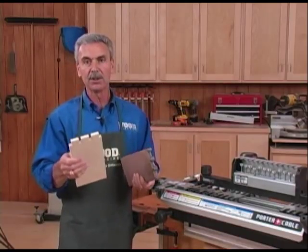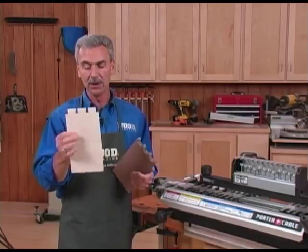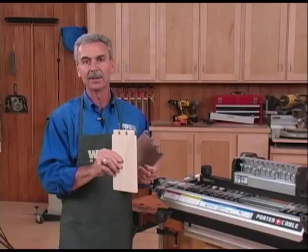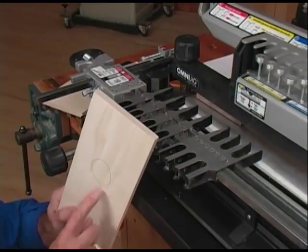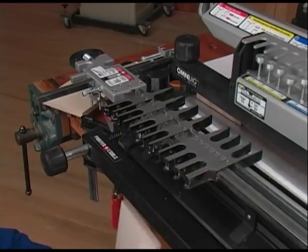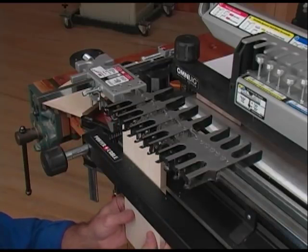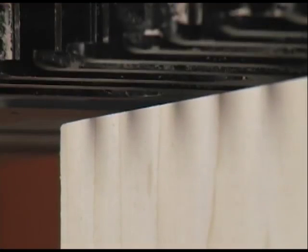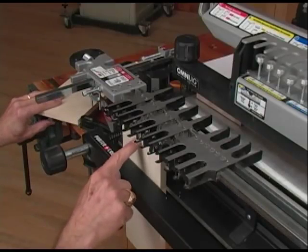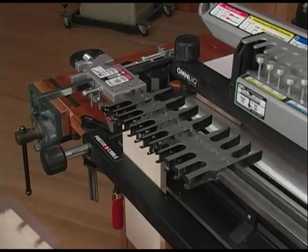And this is a pin board, or the drawer front. To do this particular joint, we're going to do the tail board first, and we're going to put the outside edge in towards the jig. All right, if I take this tail board, remember here's our mark for the outside, and I turn it to face the jig, I want to slide it up until it almost touches the fingers, but I don't want them up there all the way yet because I don't know exactly how deep I want to make that cut.